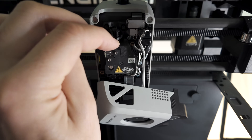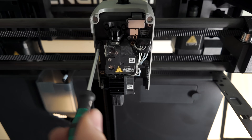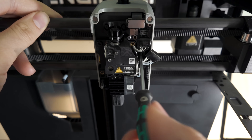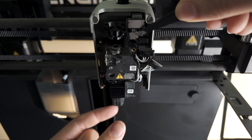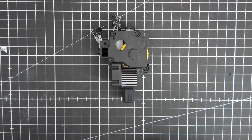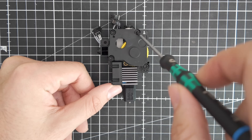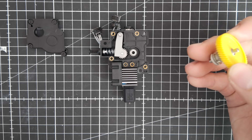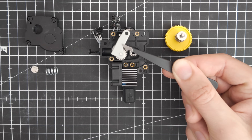Now to the assembly. First, I take off the housing and unplug all the wires, which will reveal three M3 screws. Once they are loosened, we can remove the tool head assembly. I like to unscrew the four bolts on the rear housing as well as the one on the spring tensioner. I can remove the housing, extruder gear one, the spring, and extruder gear two.